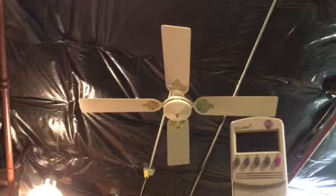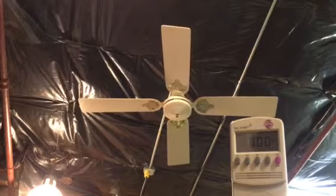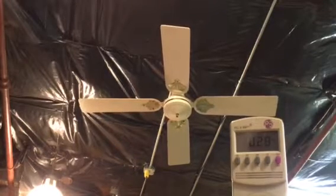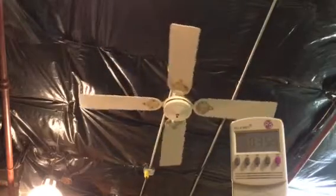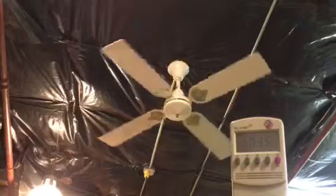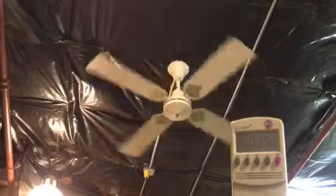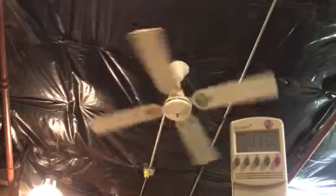Now I'm going to do the decade box and see what kind of wall control I can use on this one. It starts on eight microfarads at least. With my Envirofan, which I have on the shelf and have used in this room, I would use an 81220 just like with a Union Gold Line. I'm getting a low speed out of the 8 microfarad, so it's basically the same thing as what I have.